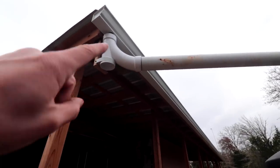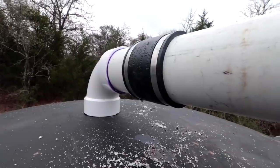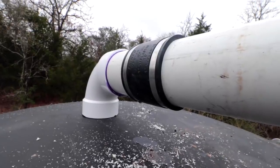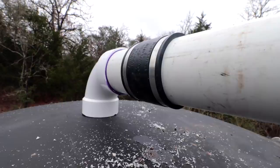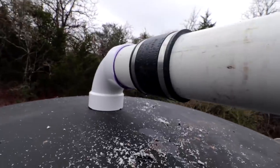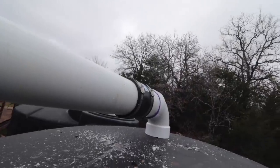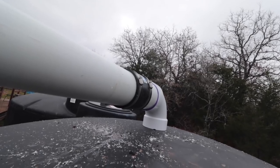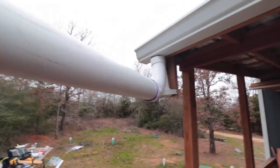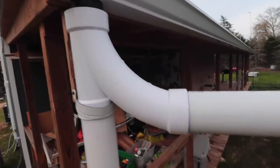Okay, so we had this and it got a little turned over there. So Pete had a great idea. That is a coupler. It's a little coupler with hose clamps for 4-inch PVC pipe, and you can ratchet it. So he just cut it with a hacksaw and strapped it so that that'll allow us more flexibility to get this plumb and flush at the end of the tank, as well as this one over here, which going down here will have the first flush.